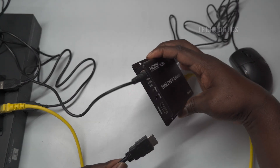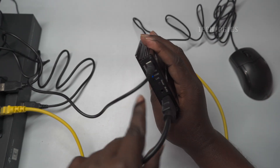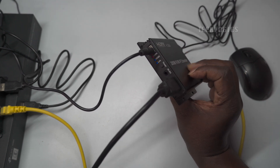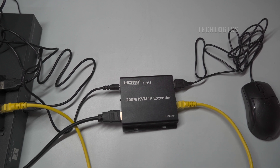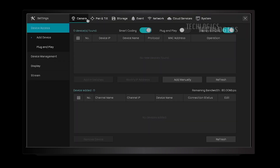The video will now be available on the connected TV or monitor, and you can remotely control your CCTV system using the mouse. On the receiver side, you can connect a USB mouse and your TV or monitor to gain access to your recording device. The HDMI output from the receiver will provide 1080p video quality, allowing you to view the live feed from your CCTV system on the display. The USB mouse connected to the receiver allows you to control the DVR or NVR remotely, which is particularly useful for managing the CCTV system from a control room or separate viewing area.